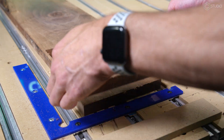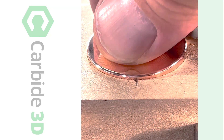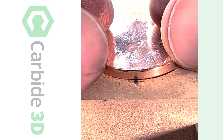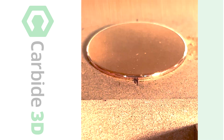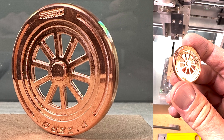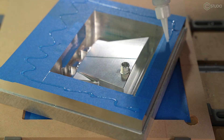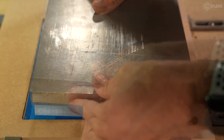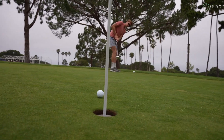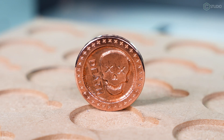Here we have some choices. Depending upon the project size, scope, or material, you can locate your stock in a few different ways. Back to the coin video: I created a workholding pocket with a friction fit and used a registration mark to align the coin on the flip — Toolpath 0 was the center. I was able to use that friction fit because the end mills and cutting forces were so small. Here we'll need more strength, but not as much as was needed on the putter project, where I cut a workholding pocket in MDF and used superglue and blue tape to hold the part in the corner of that specially made pocket. Links to both of those videos are in the description.